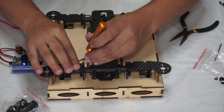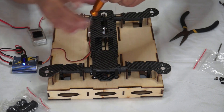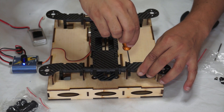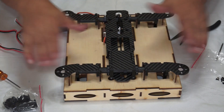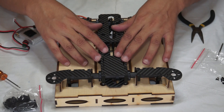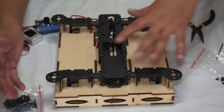Your servo might buzz during this time, but don't worry — just do it quickly. Using a hex head screwdriver, tighten all the screws making sure you are pushing them down. Using the assembly stand you can easily and quickly level out all the motor mounts; otherwise you can do it one by one as well. All you need to do is make sure the distance is right, push it down, and tighten the screws.